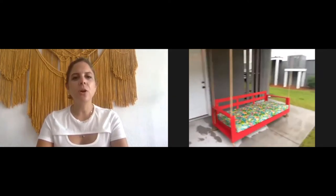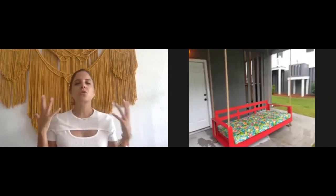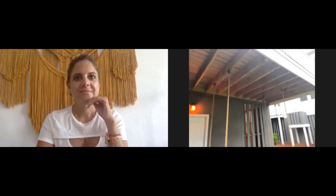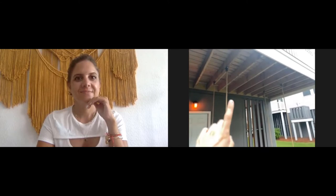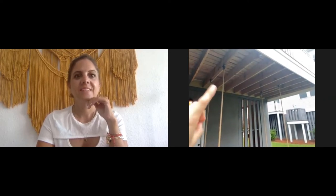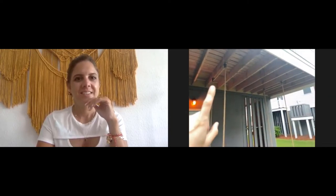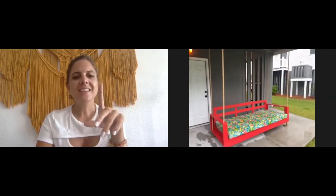That's my fear — I'm always afraid that something's going to come crumbling down, like the wall, like the ceiling. What if the ceiling just cracked down? How do you even know how much weight you can put on something? Well, I don't remember the exact calculation, but you can tell by looking at the size of the joists. Building code stipulates that different sized porches have to use different sized joists — if the porch is longer, then they have to be thicker. In this case, because of the size of the porch and the spacing of the joists, they're sturdy enough to support something like this.